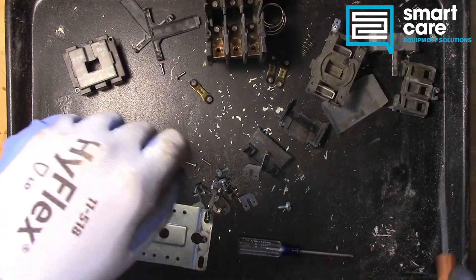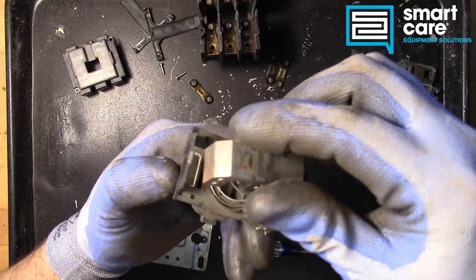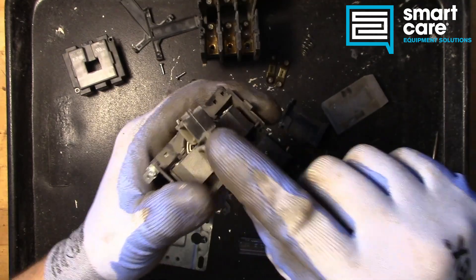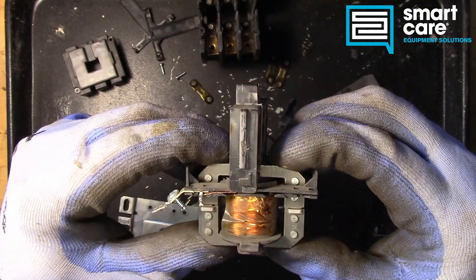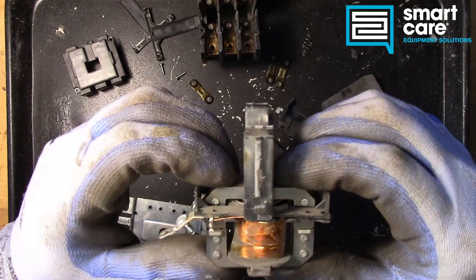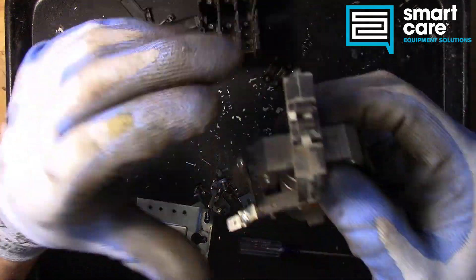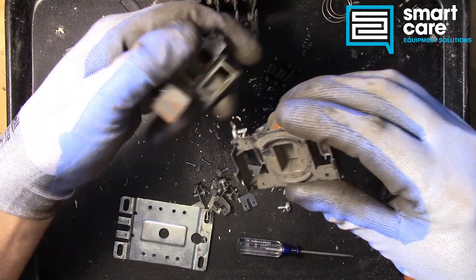This is where they fail. The coil had a spring and an iron core, and that iron core has a little cross tab that was locked onto the bracket that's actually moving the contact pads. When you energize the coil, it pulls down on this bracket and the upper part of the iron core. When you release that voltage — when you de-energize — the spring pushes it apart. Part of the challenge is that it's possible for these contact pads to stick or weld themselves together as they wear, and if that happens, the spring does not provide enough force to separate those parts again.